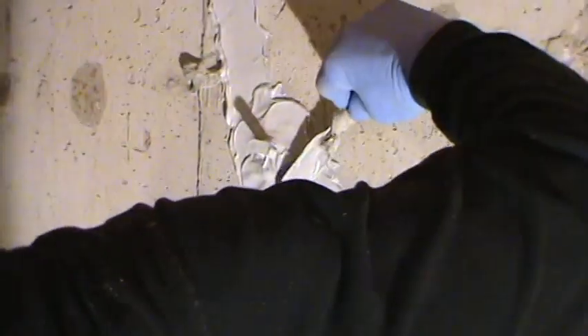After the ports are placed, additional batches of epoxy paste are mixed to seal the crack and around the ports. Normally, the top 1/8 inch of the crack is left unsealed — you're going to see why in just a couple of minutes. Any portion of the crack above ground level will also need to be sealed on the outside of the foundation. The surface seal's only purpose is to hold the epoxy resin in place until it hardens.